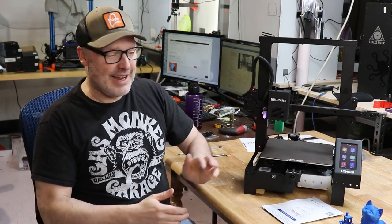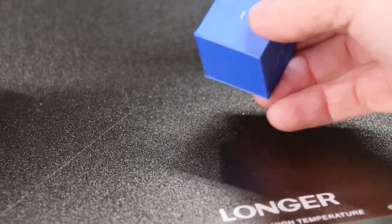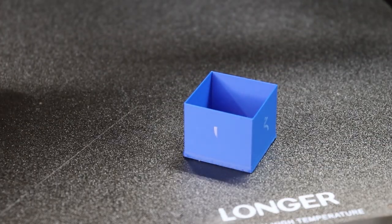When this machine is cooperating and not sagging or leading, I'm getting some fantastic prints. I did my calibration — I ran E-steps to make sure I was getting the appropriate steps for the amount of material flowing, and then I did the slicer flow settings to make sure I wasn't over- or under-extruding. The Teaching Tech wiki on his website is fantastic for this if you're new. The first calibration cube was a little rough on the bottom, but the subsequent ones looked great — printing accurately with good results.